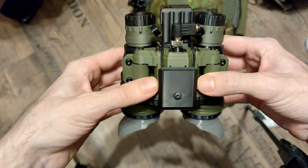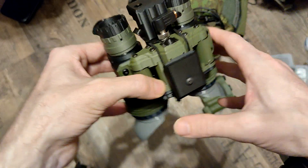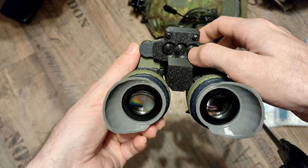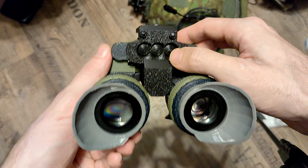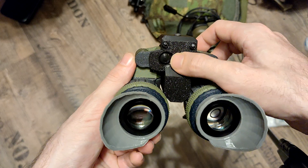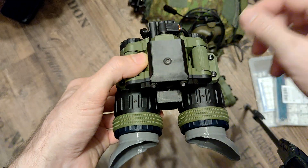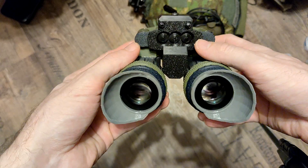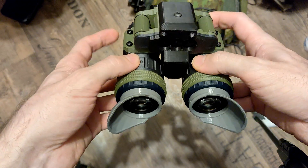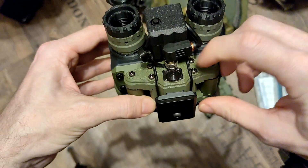Inside there's a battery and step-up booster, and here's the power switch. On the back we have three buttons: the first cycles through color palettes and scene modes, looping back to the beginning. The middle button controls different zoom states. The left button is yet unused, but you can program the ATtiny85 in here to any other camera function — sharpness, contrast, mirror flip, picture enhancements. There's quite a lot to choose from; I just added the third one because why not.